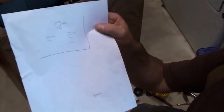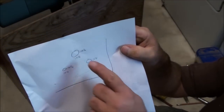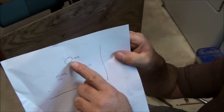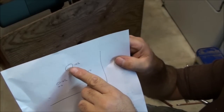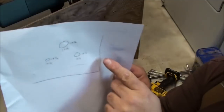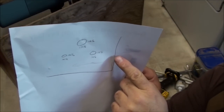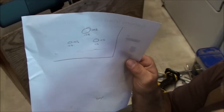What I've done here is I've taken some quick measurements of where the outlet or the waste drain — the gray water outlet — is for the wall, and also the hot and the cold hookups. Those measurements were taken from the wall to the centers of the valve.